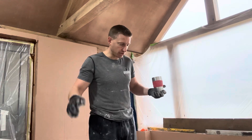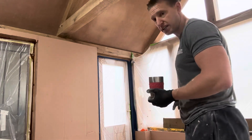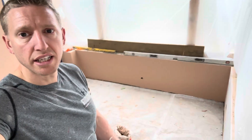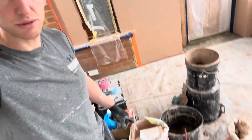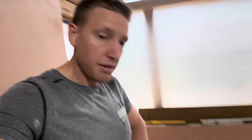I'm back tomorrow to finish off. Let's have the first coat — I've given it a quick speed skim. The second coat's all on as you can see, and I've washed out and cleaned up all the buckets and tools, getting everything ready before flattening. Even with half-time, one sachet of half-time does 12.5 kilograms of plaster — basically half a bag. So if you're mixing a full bag you'll want two sachets, as I did. For most people who don't do it day in day out and are working on their own, they might not want to mix a whole bag. That's why they sell them in two sachets.